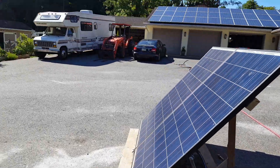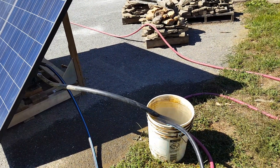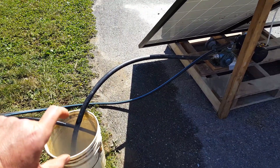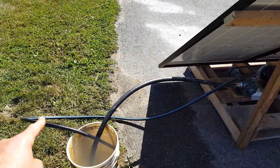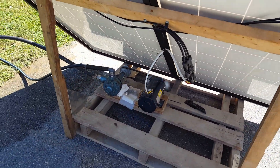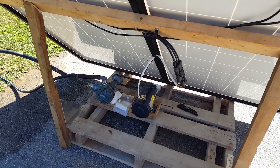I'm going to get the pallet forks, run this thing down to the creek, set it down there, and get some longer one-inch intake with a little basket filter and a check valve on it. I'm going to put the basket filter on the bottom of the intake that goes in the creek, and right above it I'll put a check valve so it keeps the water in the pump. The output discharge line goes about 500 feet up to my rainwater tanks — I've got 5,000 gallons of rainwater storage to fill up. That check valve is going to keep the whole system wet so I don't have to reprime it.